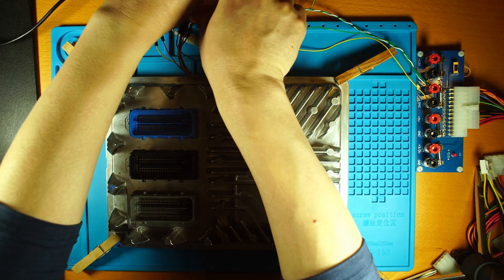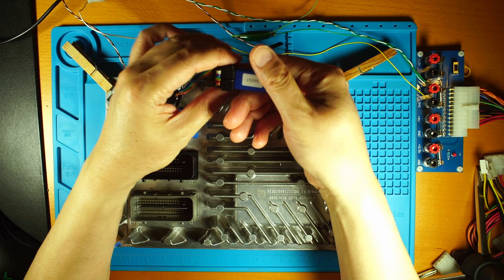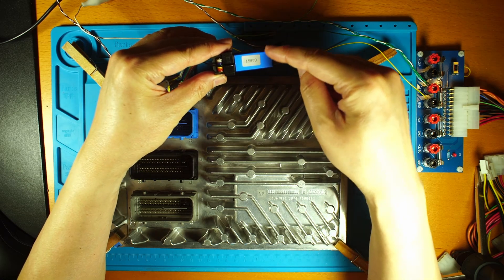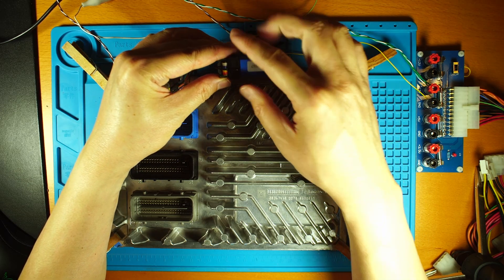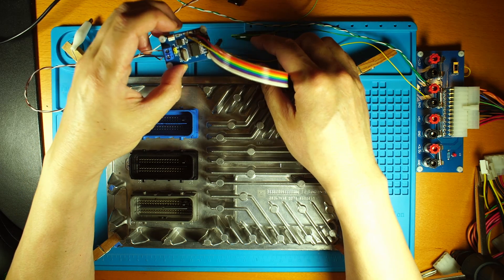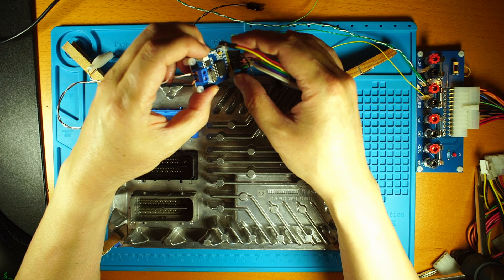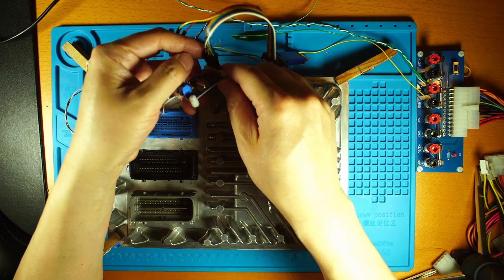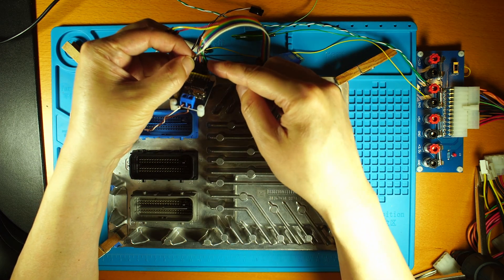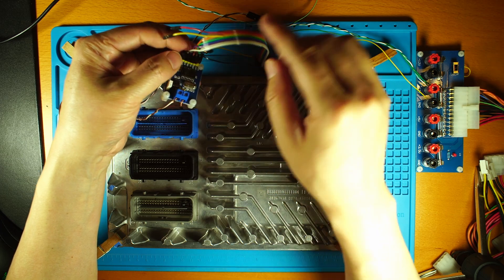Here is the U-Link MT with the modified 5V. In the previous video we showed how to get the 5V from here with the MCP2515. This board does need 5V to work properly, so the connection is ground and power. The remaining four pins are SPI pins: clock, data in, data out, and chip select.